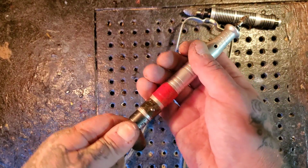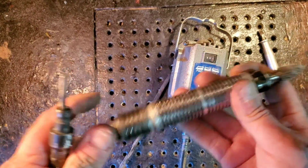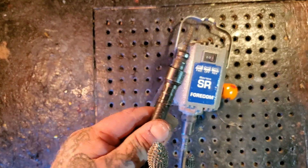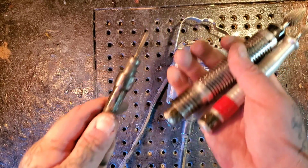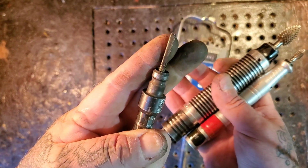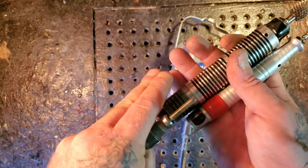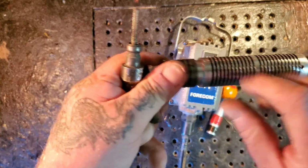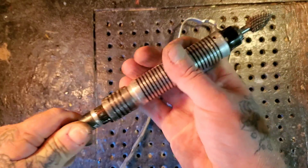So all we do to change the pieces, for example, here's the heavy, okay, one more thing too, guys. These are both heavy duty hand pieces. When you switch to the industrial flex shaft, you have to get new hand pieces too. Your other hand pieces will not fit on these industrial square drive pieces, because these are square drives. The standard one is just key drive, a lot weaker than these. So just for example, put this one on here. It should have it spinning when you put it in. It's got a lock on there. This thing will never come off, okay?